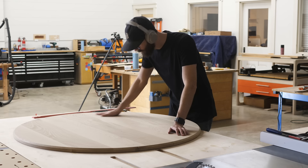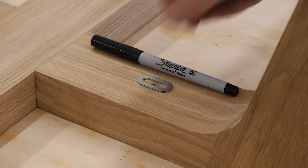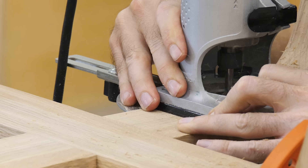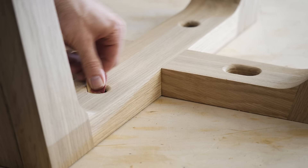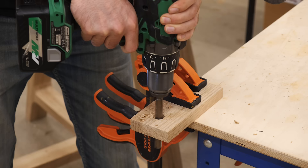In the plans we'll cover a bunch of different ways to do this, but I decided to do the hardest version, which consists of threaded inserts in the tabletop and then mortising in some elongated washers on the underside of the top stretcher. I go over this in a ton of detail so you can get the job done no problem. That said, this was definitely overkill — we also show a really simple way to achieve the same thing, accounting for wood movement, with just a drill, a Forstner bit, and some regular washers.